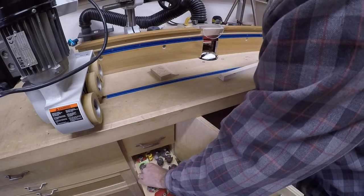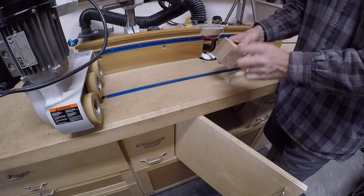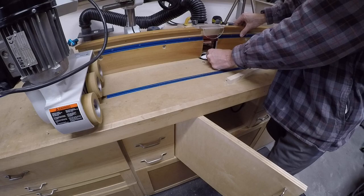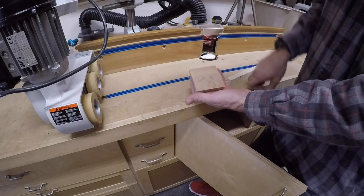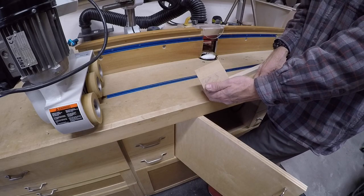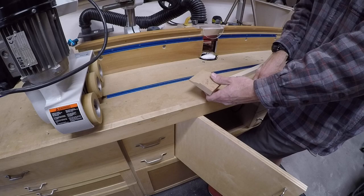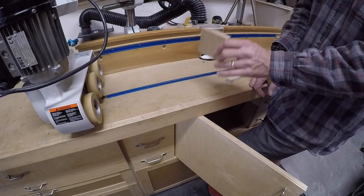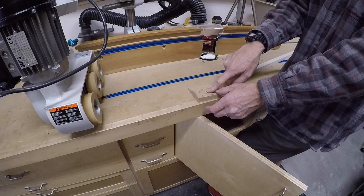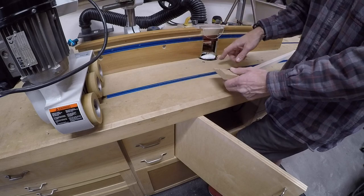Now I'm not using that particular profile, so I'm going to put that one away for height, and I can set it up for depth, just the same as you would on a shaper, except on a shaper you're working with your material face up. That's a nice feature because, let's say you were doing a lot of solid wood doors that were stain grade, maybe the doors slightly varied in thickness. This would be a really good way to do it on the shaper because the material thickness could be slightly varied, and that's going to be a problem with your tongue on the router table.